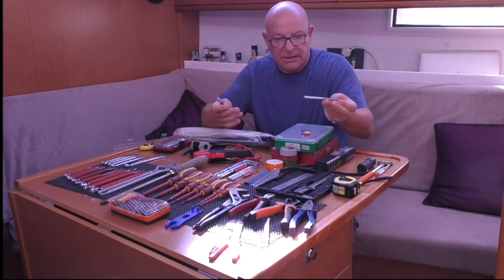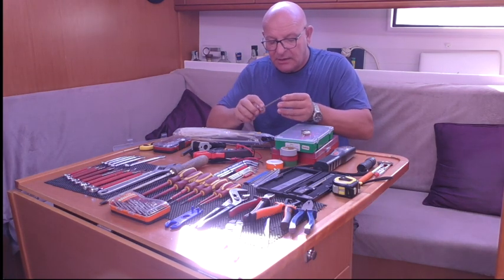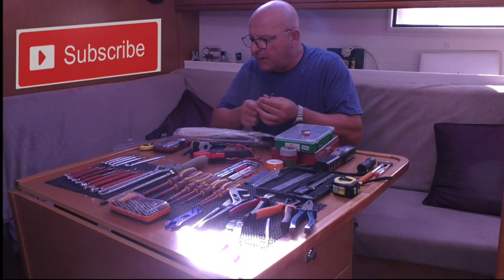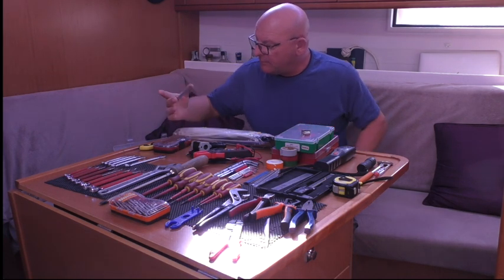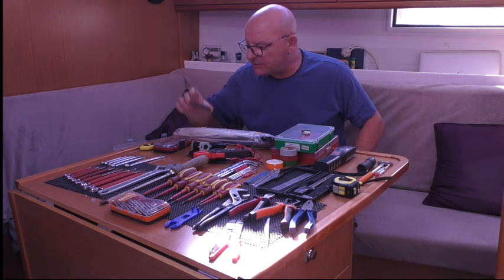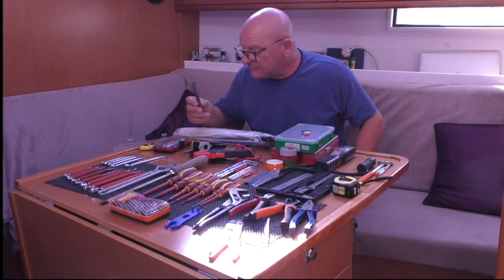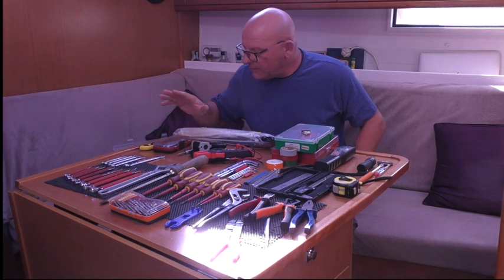This is a diamond sharpening stick - it's a bit like a file but diamond encrusted, and this one's telescopic so you can get in there. There are things you can and shouldn't sharpen with diamonds - engineers among you will know. Generally most metals you'll use on blades on a boat you can use a diamond to sharpen or hone. This is an engineer stone as well - you can use that for sharpening blades and cleaning things up. The diamond one was about three dollars and these little stones come in a pack of five for about ten US dollars.